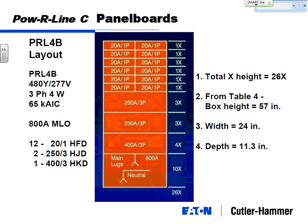What is that? Why would they come up with this? Okay. Typically on a circuit breaker, and I think they did it with like a 3-pole 100-amp circuit breaker like this, 1 3/8 inches conveniently is the size of one breaker pole. So when they did that, they were thinking a little bit. But the key to remember is it's all driven again by how much stuff you can put inside that box. That's going to determine how many breakers and how many fusible switches you can get in there.